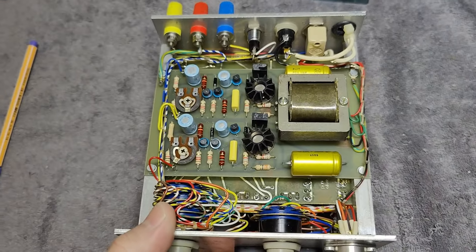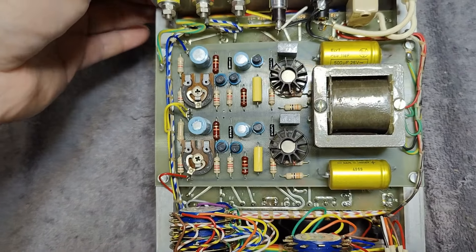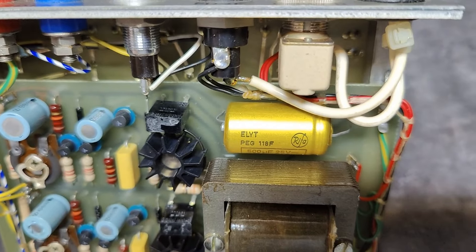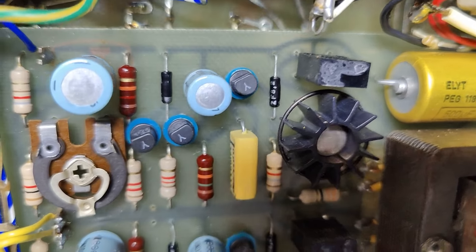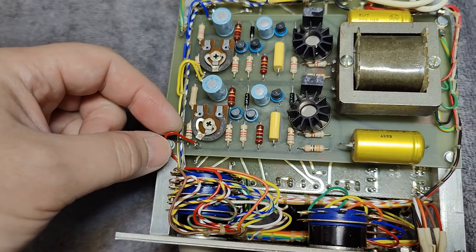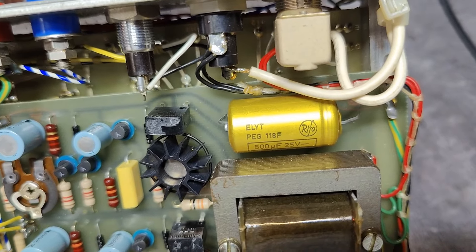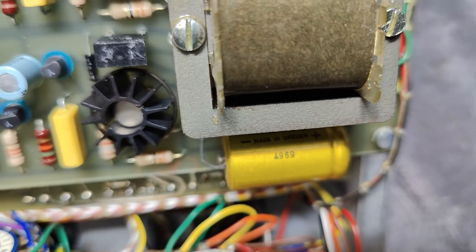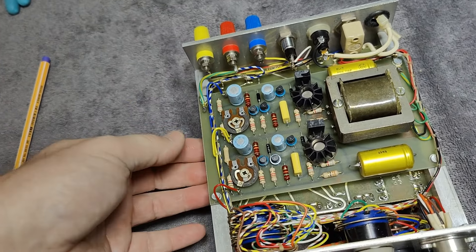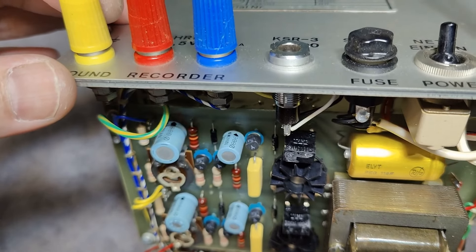Here is a nice little power supply — it's actually quite beautifully made. I think the two power supplies are more or less identical circuits. There's a little bridge rectifier, two capacitors, and a transistor regulator — running a plus-minus supply. The capacitors have a date code of 69. So is this unit really from 1969? I think the build style is almost that old, though I haven't found any other definitive proof of the year yet.